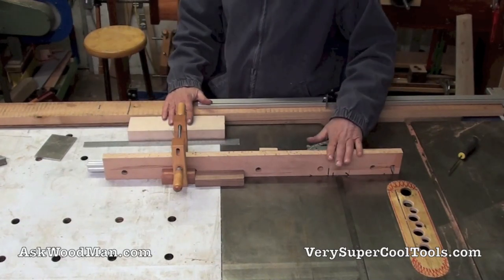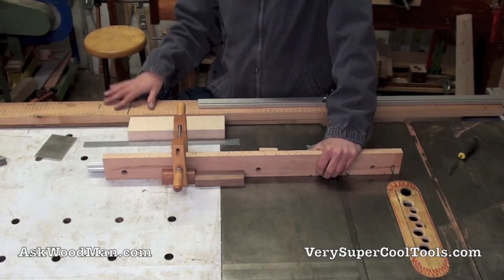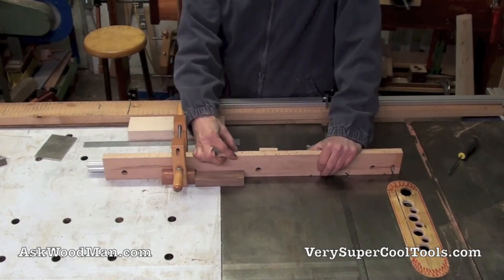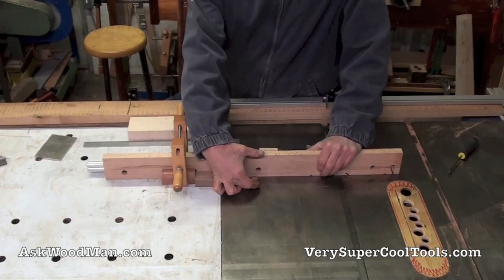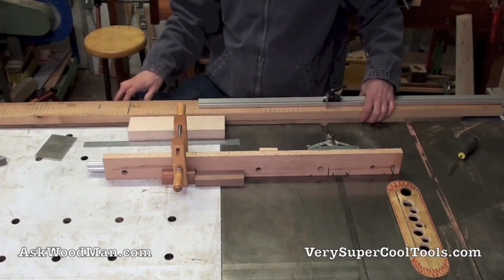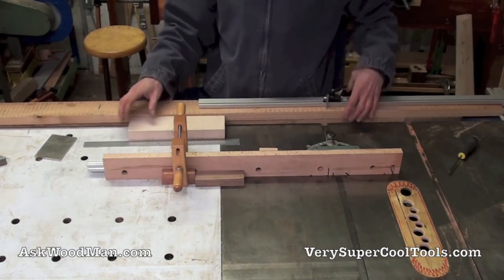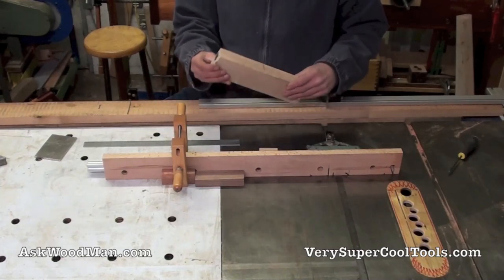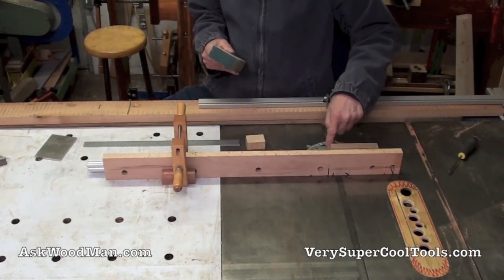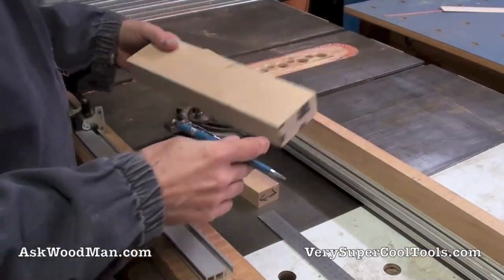I'm going to trash this current piece and I've got a couple pieces of poplar. I'm going to set a standard dimension I'll stick with forever: the fence will be seven-eighths of an inch thick and two and three-quarter inches high. I'll make two of them. I've also got a block of hard maple that needs to be no more than one inch wide so it slides behind the miter gauge.